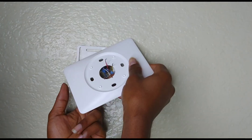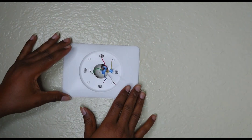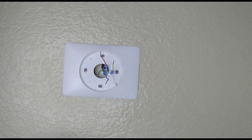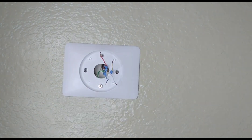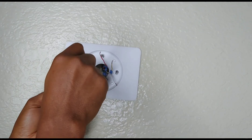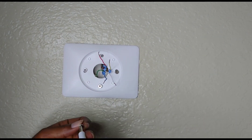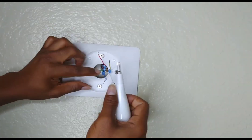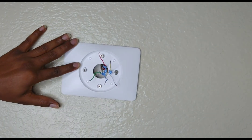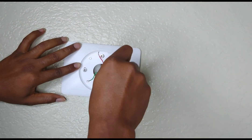It's time to install the trim plate. We'll spread out the wires so they don't get caught when we place it. We'll put the four screws on it — these screws will hold the trim plate in place. Before fully tightening, we'll use the level to keep adjusting the trim plate to make sure it's straight. We're hand-tightening and adjusting as we go — no drill at this time. It looks a little crooked on camera but it's actually straight. Now we'll tighten the screws completely.